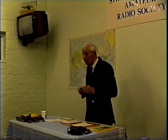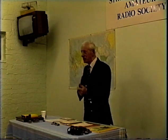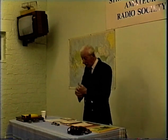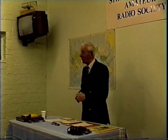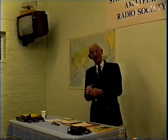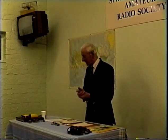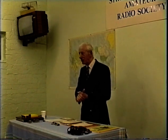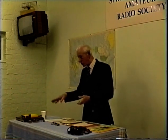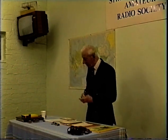My next move was how to build a transmitter. I had sneaked along one day to a twin-channel VHF unit and said to this fellow, have you anything at all you don't need — have you any crystals near 40 metres? He looked and said he could help. He gave me two crystals and said they were old ones. I said I could maybe grind them into the band — you can shift them a few kilocycles using the old trick with Brasso. So he gave them to me. While I was there, he had some valves out from changing valves in the twin-channel VHF. I saw a 6L6 and said, that's for me. He said, would you like one? So he gave me a 6L6.